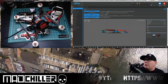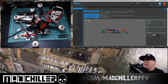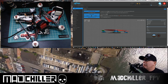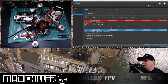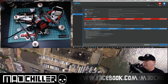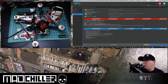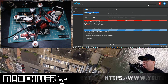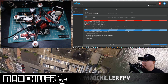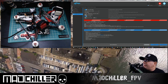It's important that you're running the latest config, which is 2.12, and you are running 0.2.0 firmware. If you're not sure how to flash your firmware, I'll show you really quickly. You just pop over into 'Update Firmware' — this is a Helio board so I'm going to the Helio targets, Helio Spring. Out of the box, if you don't have 'Show Unstable Releases' enabled, you'll see version 1. Tap 'Show Unstable Releases / Show Release and Release Candidates' and you'll have version 2 RC1 Helio Spring. Go ahead and flash that. Always do a full chip erase.